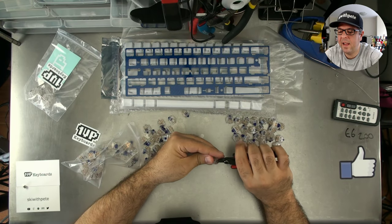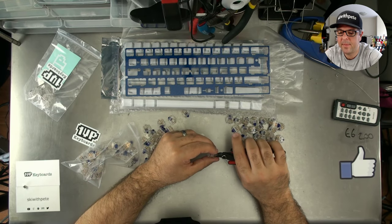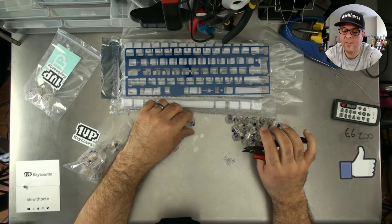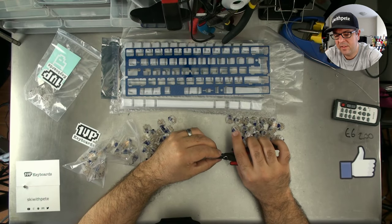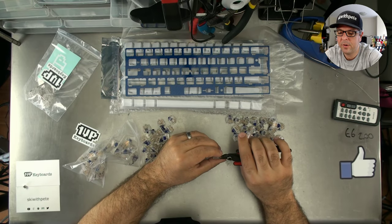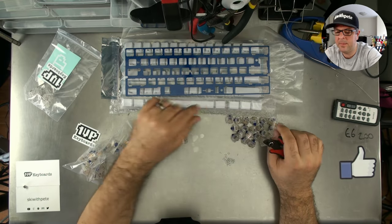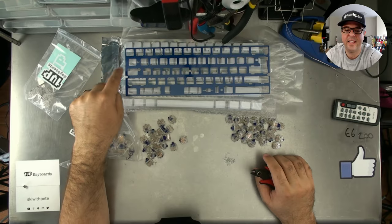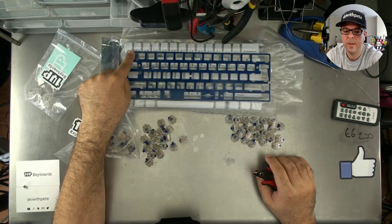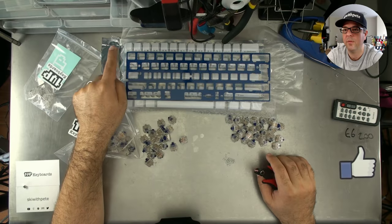Yeah, if you're going to say a pre-made, I personally recommend the Cooler Master Quick Fire Rapid. And the reason that I recommend that one is that you can open it up and you can add a piece to it called the Frosty Flake, which makes it a fully programmable keyboard. And that's actually the difference between simple boards and the more complex boards, is that full programmability. The board that I'm building today is a fully programmable keyboard. Full programmability means that you can assign any value to any key. So this top left key, instead of being escape, for example, could spell out my URL, youtube.com/skiwithpete. Every time I press it, youtube.com/skiwithpete.